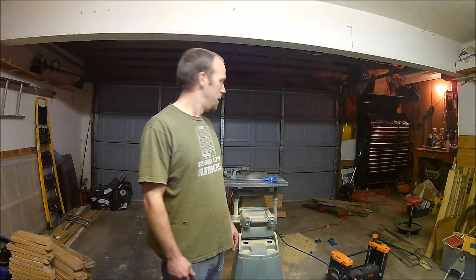Welcome back ladies and gentlemen. I've got a project I've been working on - I'm working on my garage so I need a workbench, a woodworking bench. I got some lumber from a guy who was tearing down some walls, a bunch of two-by-fours, so I'm going to build it out of that. I want it to be heavy enough that it won't slide when I'm working, but also compact so I can fold the legs up under it and set it against the wall. It'll be about six feet in length, about three feet deep, and the tabletop about three feet off the ground. So I got some plans designed up and some wood cut - I'll go through and show you that now.